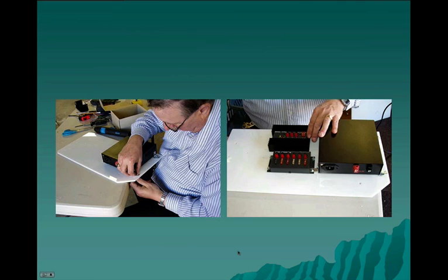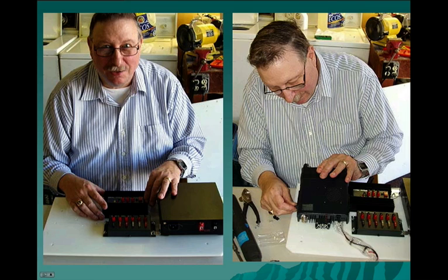Here we are assembling the power supply. We are using a Samlex 23-amp power supply — 110 volts in for 13.8 volts out. We have a rig runner and the PG-40s charger conditioner. You can see them laid out on the board with the FT-8800 being attached, and all of these items attached to the inside of the Pelican case as shown earlier.